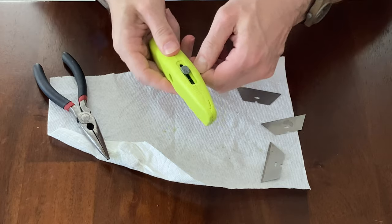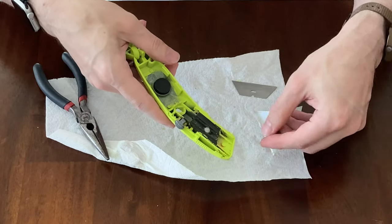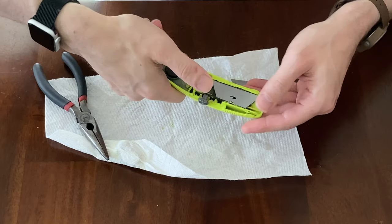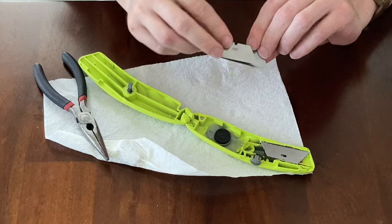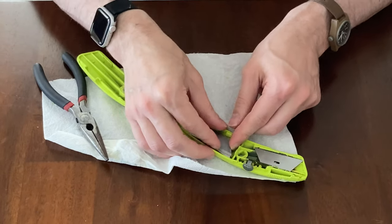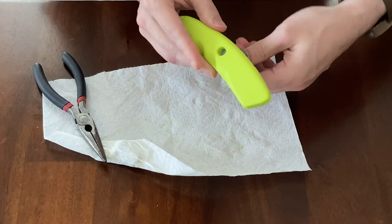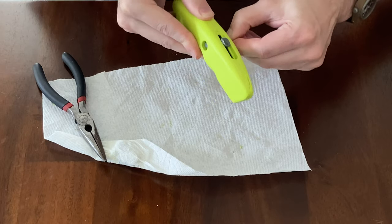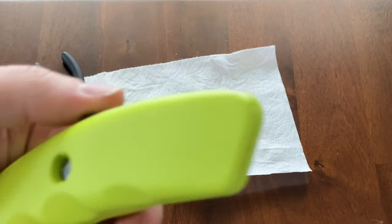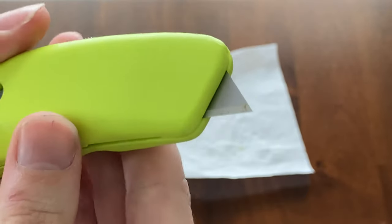What I'm going to do here is open it back up by twisting that little thumb screw, and then you can see the unit accepts a blade — it goes top small side in like that, and it presses down and locks into place. These go on the small side facing that way — it's just a magnet. Close it like that and you press in and twist, and you can see the little thumb screw actually locks on the other side. There's the mechanism in operation. You press down and forward with the thumb switch and the blade comes out just like that for cutting boxes or materials.